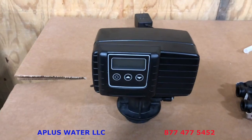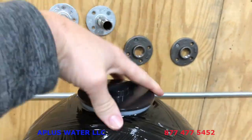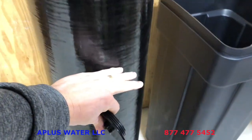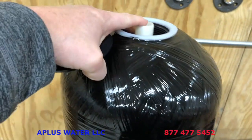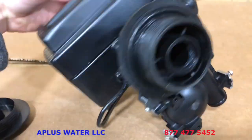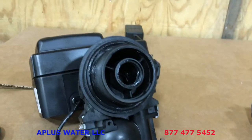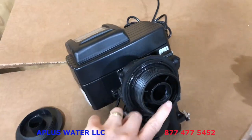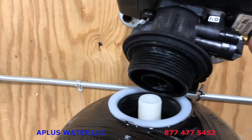The next thing we want to do is connect the control valve — the 5600 SXT Fleck valve — to the top of the tank. Unthread the cap and you'll see there's a riser tube in there, already loaded with media. The resin does not come all the way up; it's usually half to two-thirds full, allowing expansion during the regeneration phase. You want to make sure the riser tube is centered on the bottom of the control valve. On the bottom of the control valve there is a smaller hole in the middle, an o-ring there, and a large o-ring on the outside. Lubricate each of those o-rings — cooking oil works great — then center the riser tube onto the tank and tighten it.